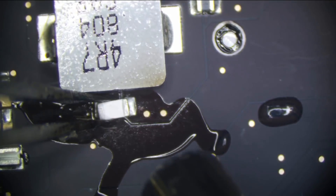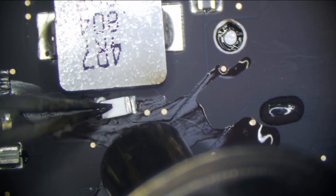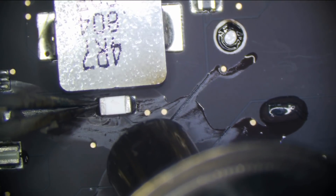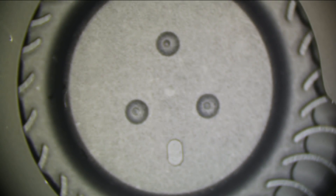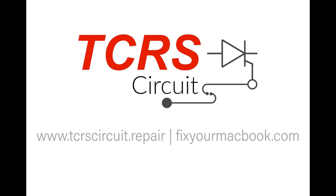This means our ISL is probably just fine. We have our fuse soldered in now — looks perfectly factory, honestly. Gonna let it cool down a little bit. Watch this fan spin — because it was a fuse on an Apple product, which is a huge surprise. Actually it's not, given the fact that that short was on PPBus. The fuse blew. Okay, it's probably cool enough — still no fan... there we go, there's fan spin. And this board is fixed. Spinning fan.